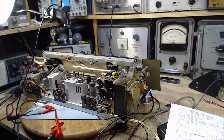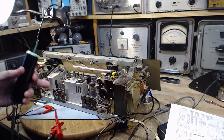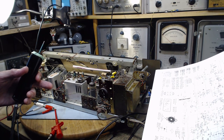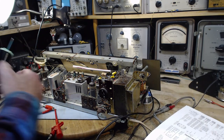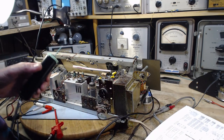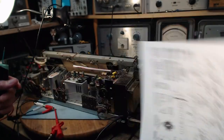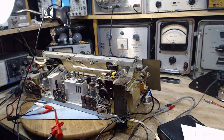So the thinking here is pin number 8. There's nine pins. Which way do they go? They go the other way around, don't they? So 9 is at this end, 1 is at that end. Schematic, please. I can't read anything like that. Okay, just one sec. I'm just going to peek on my own and make sure I know. I think it's 8 between 9 and 7, isn't it? So 8 from the switch's point of view. Wait a minute, I still don't have it here. 8 is the output, 7 and 9 are the two inputs.